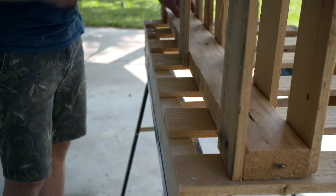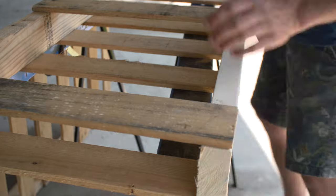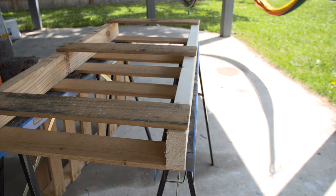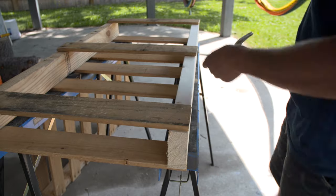Use two nails in each plank, and once you finish doing that, you can flip it over and nail in the planks on the back to the new supporting 2x4 as well. These don't have to be lined up with anything but they should look more or less square.